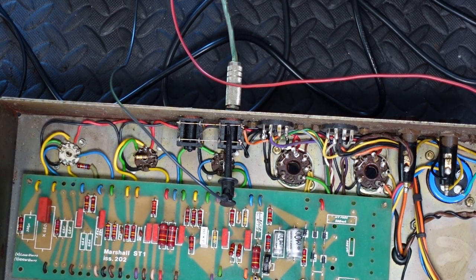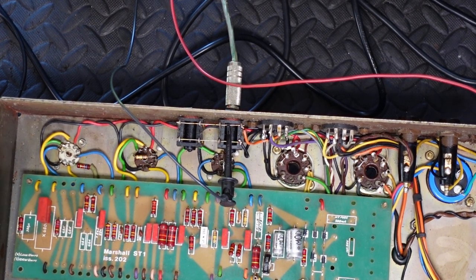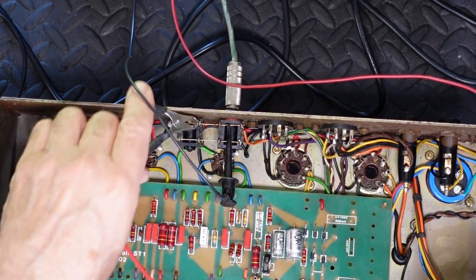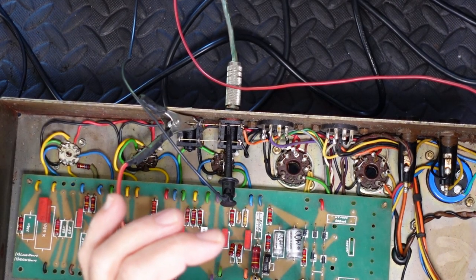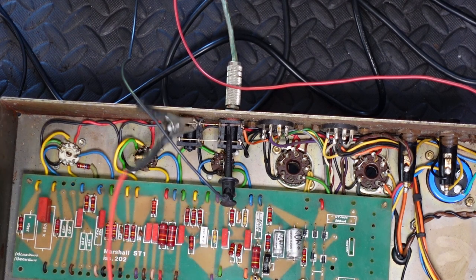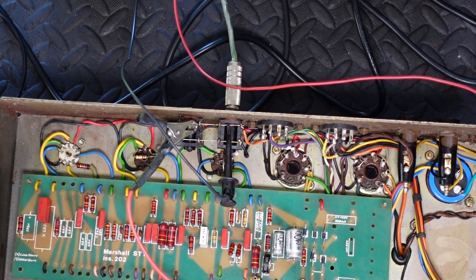All right, so now I'm going to power down, discharge my brand new filter caps. I'm using my super duper discharging tool, which I'll show you how I made one day. So this one clips to ground because I keep forgetting to unplug it, and I'm sick of replacing my 100 ohm resistor in here. I've got a fuse in there that blows, but of course now that I've put a fuse in there, I never forget to unclip it. So I'll now put this on that first reservoir cap, and that will be discharging pretty fast. Already it's down to 0.4 of a volt.